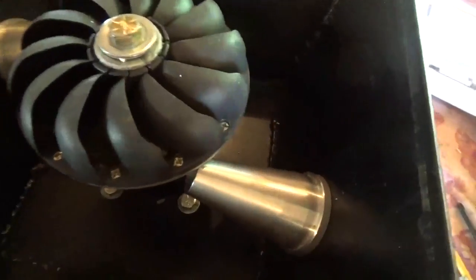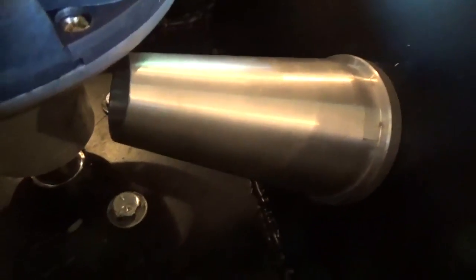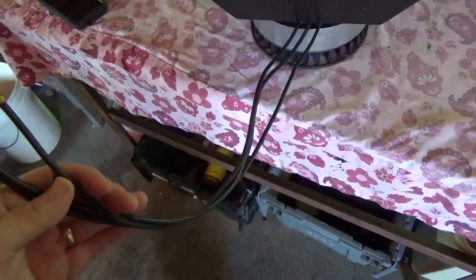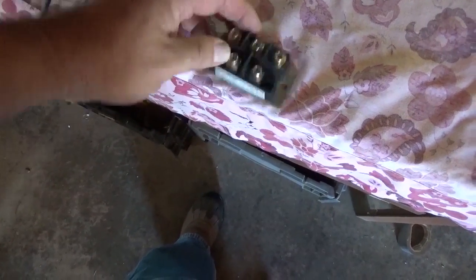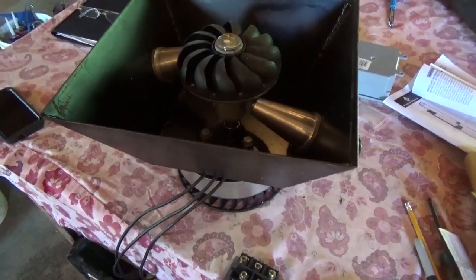Here's the turgo upside down. The turgo wheels have a little different geometry than the Pelton wheels. We've got two nozzles — it's going to be dual. Right now we've got our nozzles at 22 millimeters. We're going to run these three leads about 250 feet to a bridge rectifier and convert to DC, and take that to our charge controller so we can charge a battery bank. We're going to be basically working on a 24-volt system overall for this gentleman.